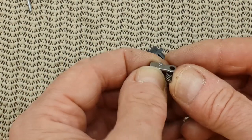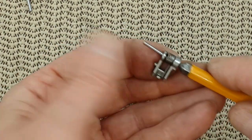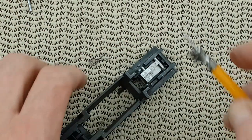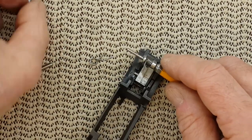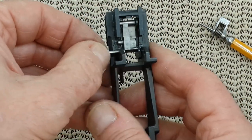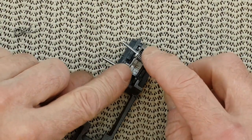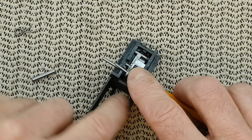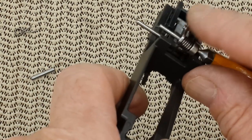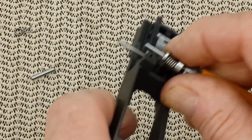But let's go back to that spring here. Now we need to compress this spring and it's pretty hard to compress. The best way to do it is to put a punch right here. So now you can see the part, and that is how you put the punch in. Then you are going to start that thin little pin that goes right here. You put it on standby. You are going to compress that branch of the spring by putting it against the frame like this. And then, by keeping the punch down so the punch does not move, you are going to compress that part here. If it slips, no big deal — the punch is holding everything.